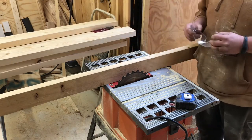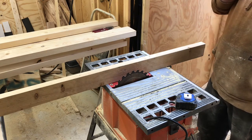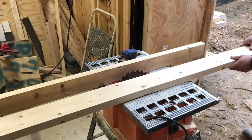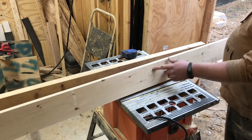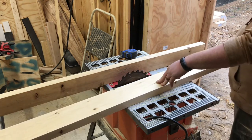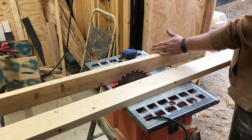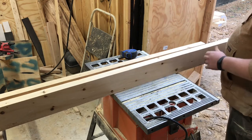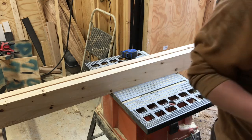Please make sure you're wearing safety glasses when doing this. If you don't have dust collection, get a mask. I went ahead and marked all my boards with a 'B' on the back side — that'll be the bottom of my table top — and I always put the B towards the fence because we want to rough up this edge. Go through the material and mark it, because you only want to do one side. This is a little time consuming.